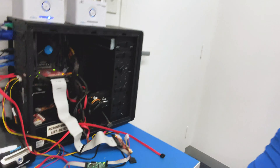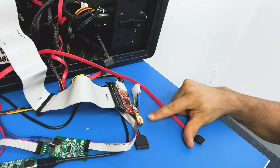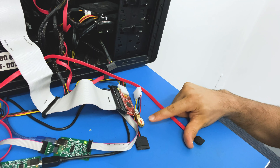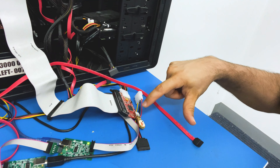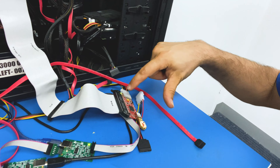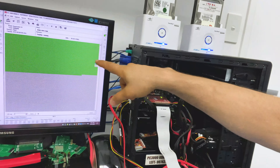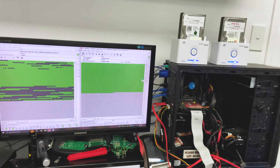Another interesting case — if you look carefully right here next to my finger, there's a gold-colored USB flash drive. It's a little tiny flash drive that looks like a little dog's head. It's plugged into a converter that converts USB to IDE, which then goes to our PC3000 — and that's what you see here at the moment. It's all green, which means good data is being copied, except for that one part, but now it's copied.